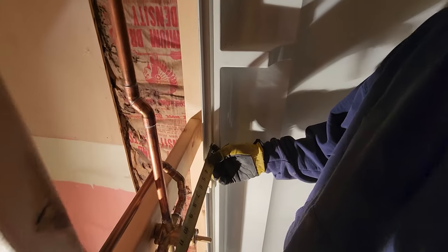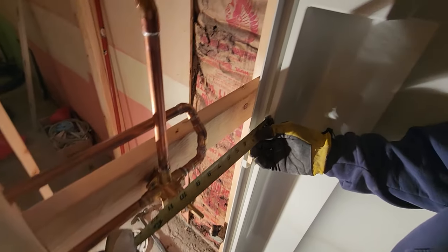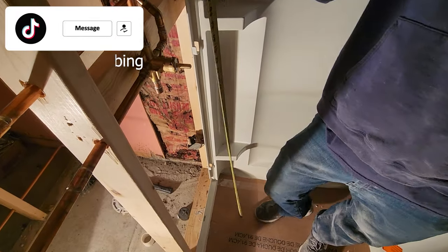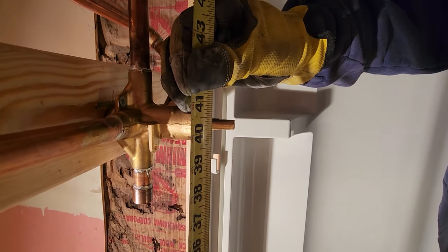We use either a three-inch or a four-inch hole saw bit. When you buy your shower valve, it's going to come with that round trim plate — the chrome or brushed nickel piece the handle sticks out of. Basically, you just need the hole you drill in the fiberglass to be smaller than that trim plate. Mike's measuring off the bottom and off that right wall.